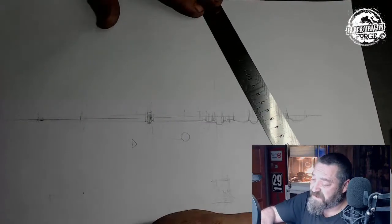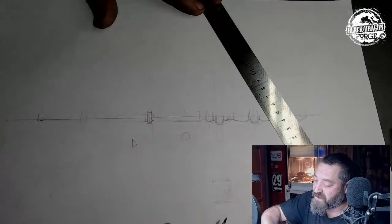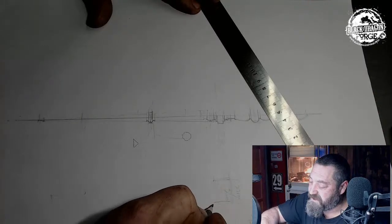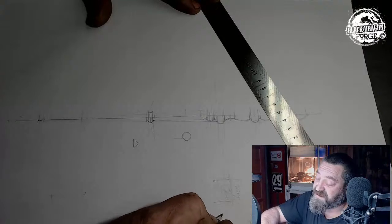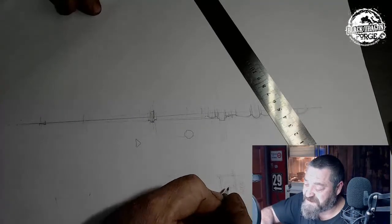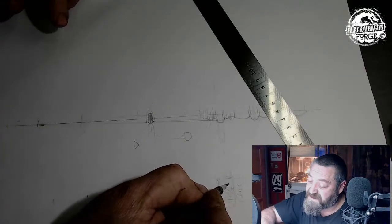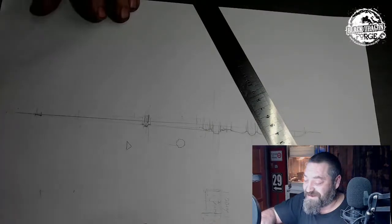Okay. So that scene from this angle, that is just purely a cross section. That there is going to be 20 millimeters, and then my height is 12, 14, 16, 16 millimeters in height. So that's pretty much it. I want that 2 mil spacing there. And I'm pretty sure if you now go mathematically work it out, that 2 mil there versus the spacing on this side is actually going to give you that golden mean again. Yeah, you can go and work it out, but as long as it looks good.